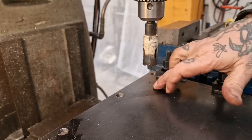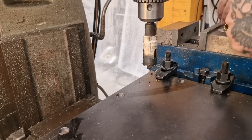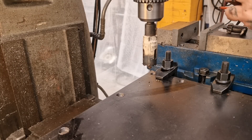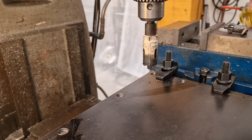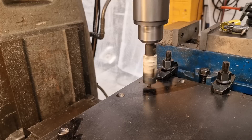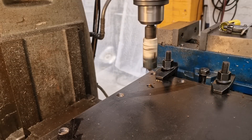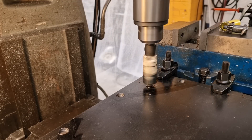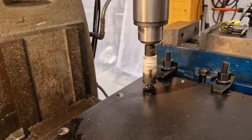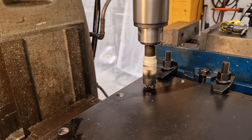On the two biggest plates we'll have a one-inch hole, and on the two smaller ones we'll have three-quarter inch — that's 20mm. Hopefully this will behave in this gear because I don't want to have to change the speed — the next speed down is way off. Let's see how well it goes. We're all good and clamped and supported — physically, spiritually and mentally. Not sure about emotionally.